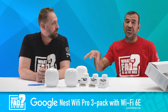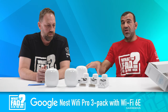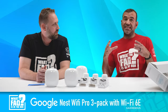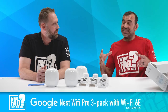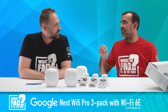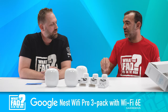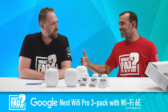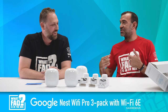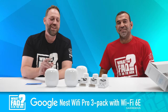With Wi-Fi 6E you now have the capability to utilize the 6 GHz band and you get reduced interference — great for integrators doing MDU jobs in dense areas. They added BSS coloring — basic service set coloring — which introduces 64 unique color identifiers into the data transmission. So if you and your neighbor are both streaming, your signals are tagged with different colors, keeping your devices separate and preventing interference between households.